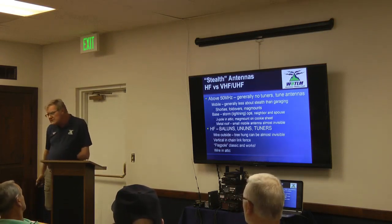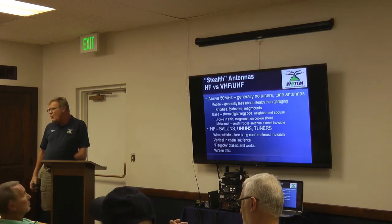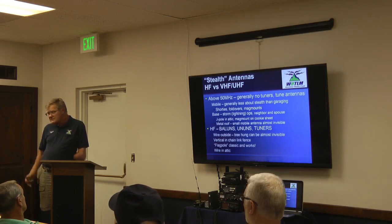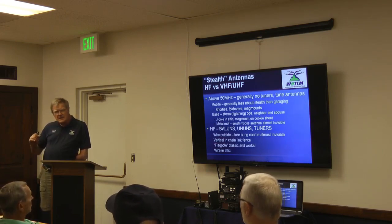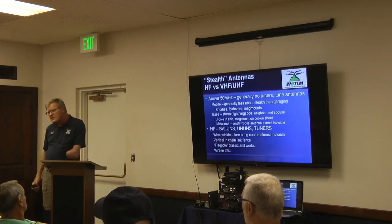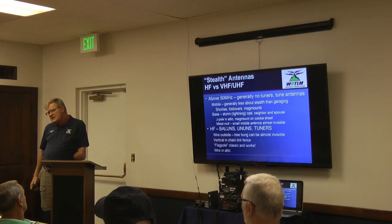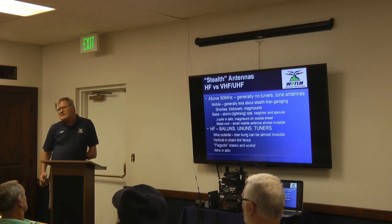I'm going to talk about legal issues in a few minutes and power issues. You just need to be aware of what you're doing with RF power. And if you put it in the wrong antenna, like some little HT antennas you can get to plug into your HT and stick on the roof of your car, most of those, if you put 10 watts into them, they're okay. If you put 75 or 50 watts into them, maybe not.